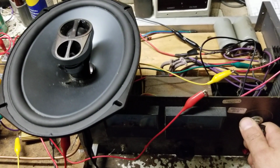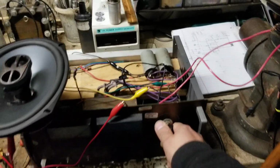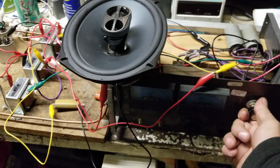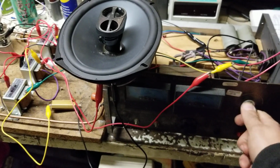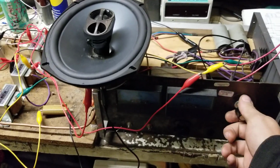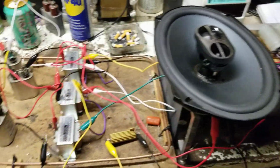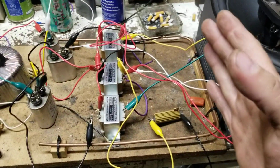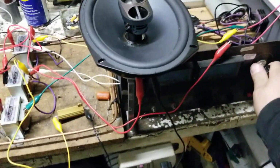you can hear harmonics coming out in the 2 speakers as I turn this, and it's not even turned on, right? So I'm varying the tap on the secondary and to tune it with the other wall over here. But so that's only energy coming this way, obviously out of the back of the MagAmp. There's no pushing back yet. Now I'm going to turn this all the way down